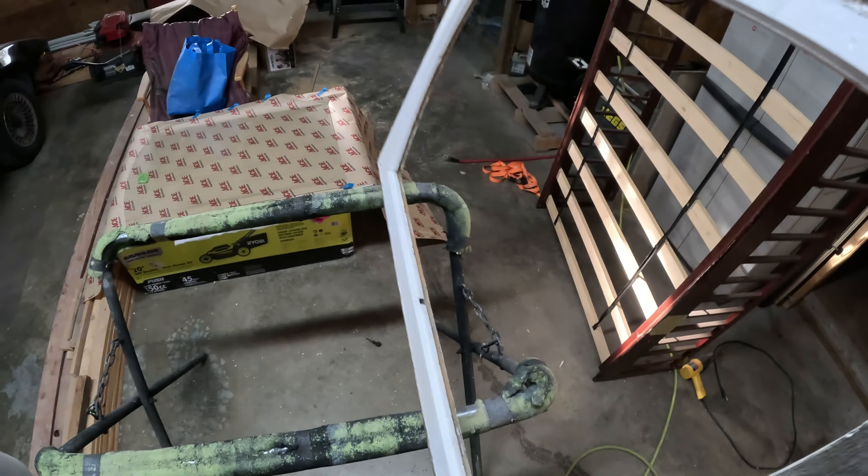Now to strip this thing down, you do want to make sure your glass fits after you tighten it up, because sometimes these sashes are repaired and they leave a little gap — then they put a new glass in with that gap, and when you go to fix it your glass might not fit. Always test fit it. I'm going to test fit mine now. If your glass isn't wavy and it's fairly thin, it's a replacement glass. Just test fitted the glass and it does fit, so we're good to go — strip it, re-prime it, then put the glass back in and glaze it.